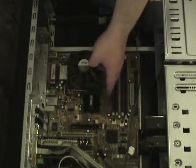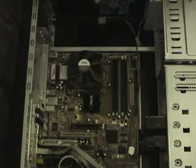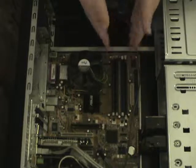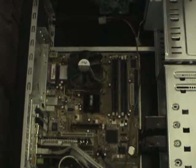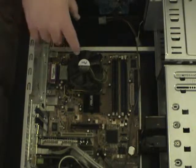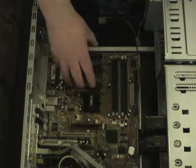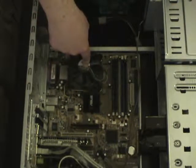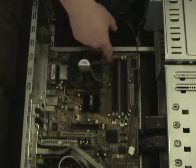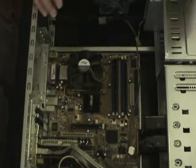And on these, you're going to have the outside cooling, which means the cooling is going to be slightly better on this than on one that has all four slots crammed together, and you're not going to get any cooling that way because you have no airflow. That's another reason why this fan up here is also important, because as this pulls down onto this, you're getting cool air, and then the cool air is getting accelerated even more by this, and then it's going to blow over here, it's going to hit your RAM, it's going to cool your RAM some. So you want to look at that.